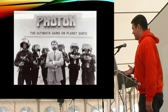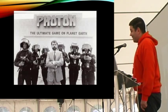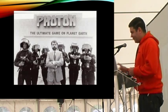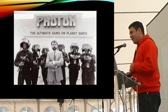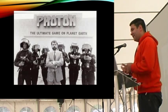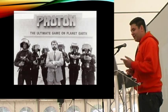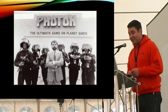There was no laser in the first laser tag system - it was just purely infrared. They had a little LED that lit up at the end of the gun when you fired. The most interesting thing about this system is it used a system known as reverse infrared, which is very unusual. There's only one system in the world at the moment that I'm aware of that makes use of reverse infrared. When you aim at somebody and pull the trigger, it actually receives infrared from their vest, then transmits the hit over radio to the other pack. This system used to take the best part of half a second from when you hit somebody to when they died, which is a long time when you're playing a game of laser tag.